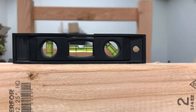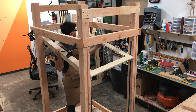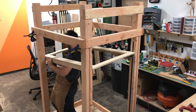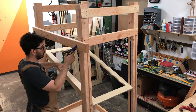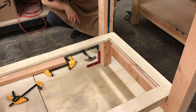Now that the floor is flat, I dry fit the outer frame with clamps and test one of the plexiglass frames. Surprise — new problem. If there's any imbalance in the frame, it locks up like a rusty old gate. After some tinkering and a bit of head scratching, I adjust my measurements, square things off, and create more space for the frame to move freely.